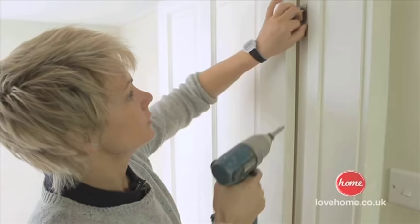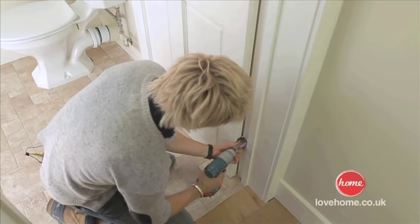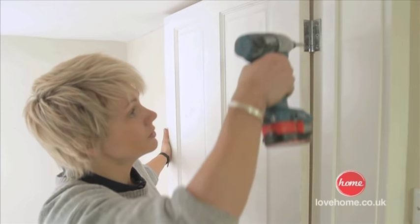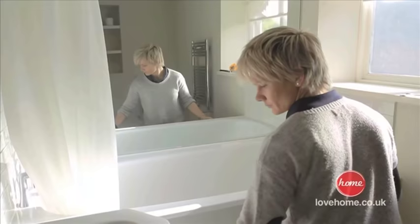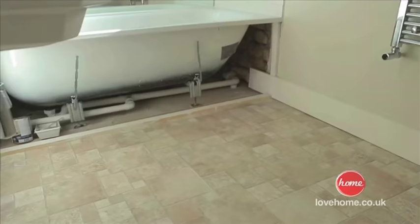When you're taking a door off, leave one screw in the top. If you were to take all of them off, it would just drop — and you do risk either ripping part of the wood with the hinge or the hinge coming off completely. So just leave one in and take all of the bottom ones out. With one hand support the door, the other hand slowly take it off. Just let that drop and then we can take the door away ourselves.